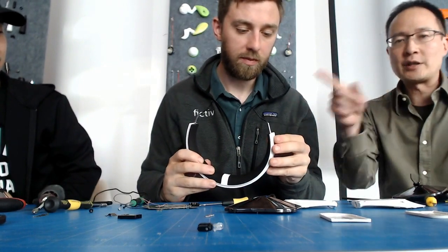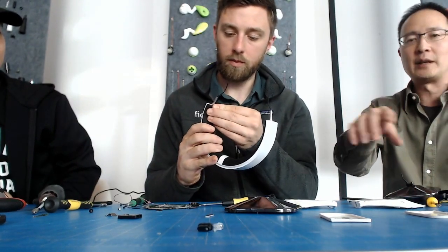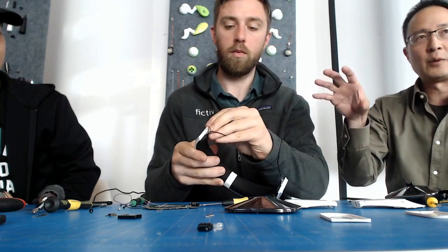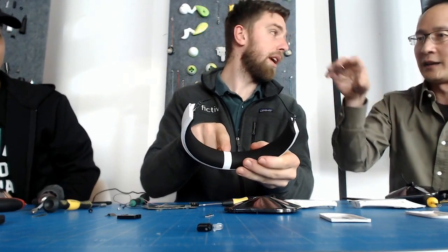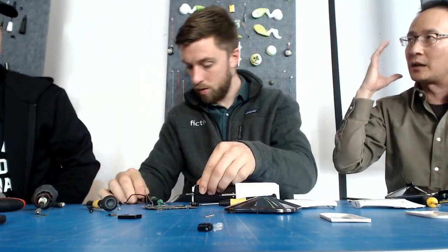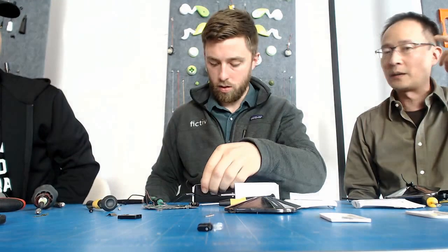Yeah. So that was actually one of the more challenging aspects, besides all the other mechanical trickery we had to do in the hinges and the joints, because the success of this product really depended on the headband working. That's where the vibration is generated, which is up here, and transmitted into your skull. But it's also transmitted down the sides into the ear cups, because you actually can feel a bit of that vibration through bone conduction on the ear cups despite the padding.